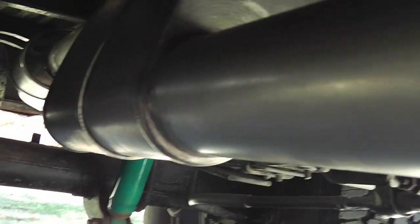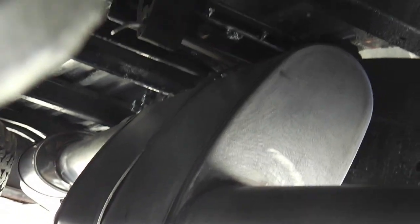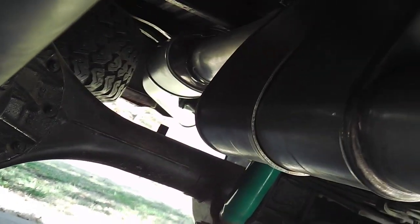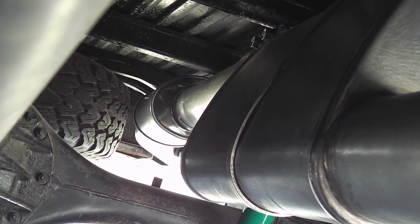I knew that I'd continue at some later time with stainless. And then I forgot that I had already necked it up to 2.5 inches from the 2-inch factory. So I just thought, oh, it's 2.5 down there, so I want to neck it up 25% to 3 inches. But no, it was 2 inches, and I went to 3 inches, so I actually enlarged the tubing by 50%, which wasn't a problem. But tubing's a little more costly, and the mufflers with the larger inlets probably just a tad more costly too. So you don't have to ramp it up to 50% over the stock tubing, but it wasn't a problem.